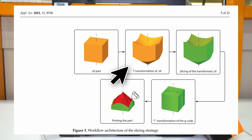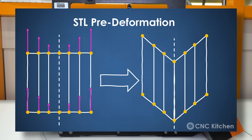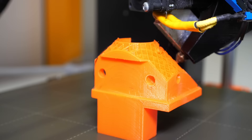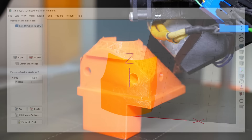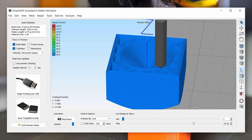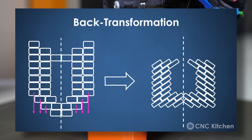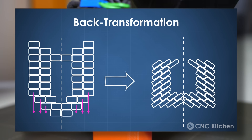Very generalized, with a common FDM 3D printing slicer you can print overhangs in a ±45° window. Common belt printers, which have an angled nozzle, tilt that window to 0 to 90 degrees. And this is where the Rotbot improves on. With its rotational printhead it can reach all around the part and increases the window to around ±90°, which allows completely overhanging structures on all sides without any supports and therefore generates cone-shaped layers — hence the name conical slicing. Conical slicing is the method used to generate the G-code for the printer. They didn't program a whole new slicer but simply trick regular software into generating the paths and then modify that code with a bit of Python script. There are three steps: pre-deformation of the STL file, slicing that pre-deformed STL in a regular slicer, and back-transforming the G-code.